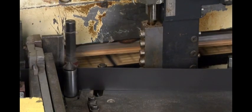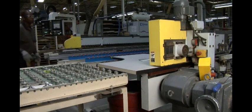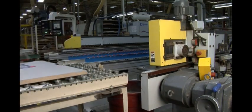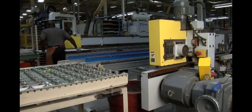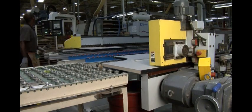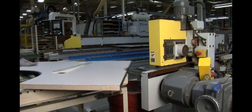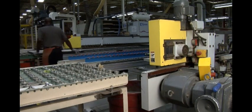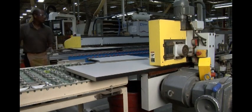EB-60V slot guns can help reduce maintenance and material waste when used as an alternative to open glue roller systems. Particularly as part of an automated edge banding system, a Nordson edge banding adhesive solution helps optimize equipment utilization. The closed system protects against airborne particles getting into the adhesive, as well as excess adhesive potentially contaminating the surrounding work area and equipment.